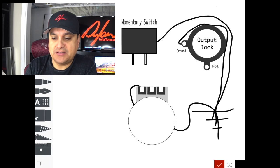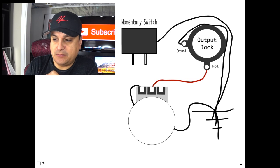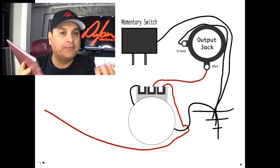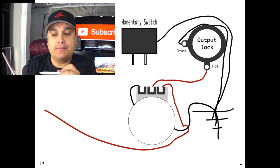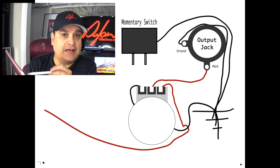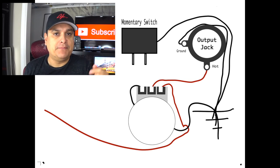Let's put our signal wires in there, and I want to take the time to explain why we're hooking this up a certain way. We've got our signal wire that goes to our hot, and then this other one hops over and goes back out to the guitar — that would be your pickup selector switch, or your pickup if it's just one pickup. A lot of people would think that you would just put the momentary switch in line on that hot line and cut it every time you wanted to kill the guitar. But that would end up being kind of loud — it would sort of be like when you pop your cable out and it makes that pop noise. That's what would happen if you put a switch on the hot to your output jack.